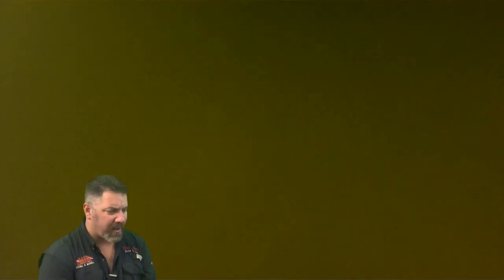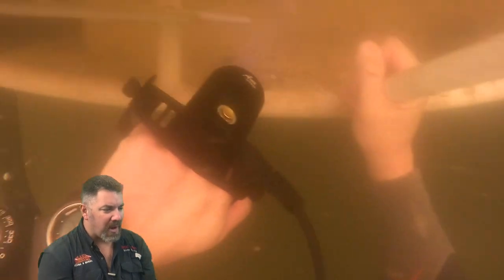We're also noticing any debris in the way and noticing the attachment point of that rope there. Where the rope was attached may be an attachment point. There's metal railing that goes all the way around this vessel, but I try my best not to use railing to lift with because a lot of times it can just break free — that can be dangerous for us and it could damage the vessel. There's a cleat there we could possibly use, but I really don't like using cleats primarily because cleats break away very easily, especially if it's in fiberglass. Lift bags can pick up on those cleats and shear those bolts or pull them through the fiberglass.